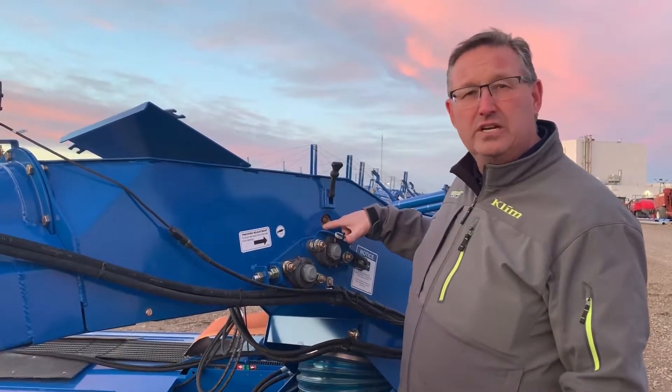The main thing is to look at your drive rolls. This also applies on your 1547, 1545, and 2045 — open that up and have a look at it so that it's not slipping and you get a failure when you want to use it. Thanks for watching, hopefully that helps.